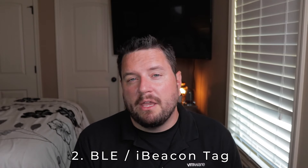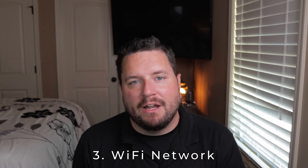You can choose any ESP32-based device for tracking. You'll also need some sort of BLE device like a beacon. I'm using Tile trackers because of the capability to track them in the wild. The Tile trackers do have a Home Assistant integration, but it's not super reliable for specific tracking — it's more of a nice secondary feature if you lose one. For this project they're 100% compatible for finding them within your house. You'll also need a basic Wi-Fi network to get data from the tracking devices out to Home Assistant or your MQTT broker, and finally you'll need an MQTT broker — Home Assistant has one built in.